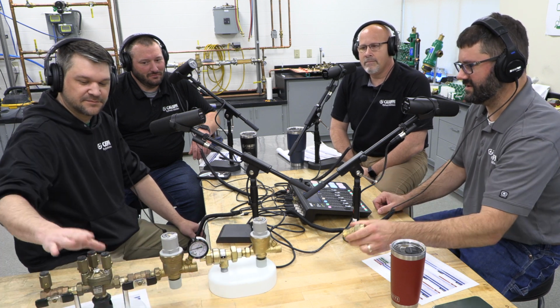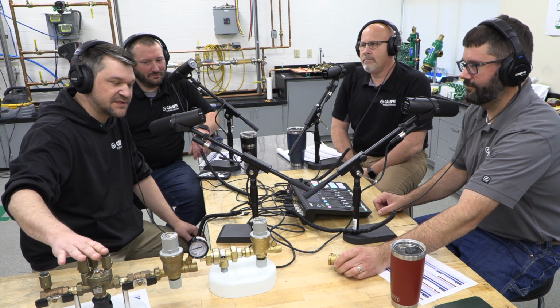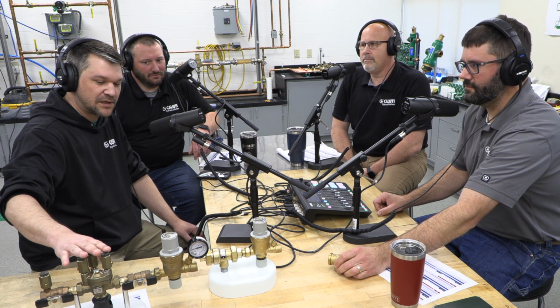Here we go talking about ASSE once more, but that is a standard that's pretty important, right? It's the checks and balances of standards. Yeah, absolutely. So the double check with vent, that's going to be an ASSE 1012, and then we have a 1013 over there. 1013 is the RP. So this is a testable assembly. This has to be tested on installation and annually thereafter.